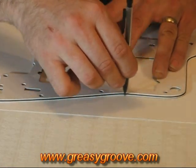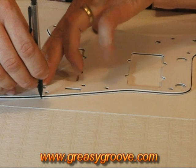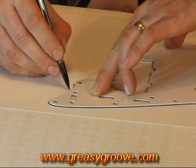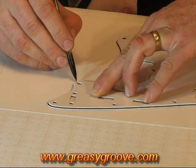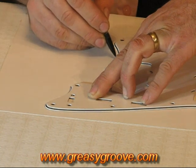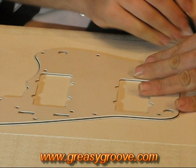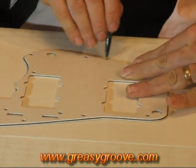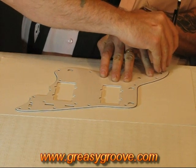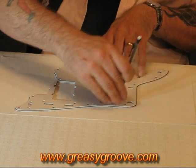So I'm going to first of all draw around the perimeter. I'm just taking my time as I go around. What I'm doing is keeping the lead on the pencil pointing towards the guard and pointing towards the edge of the guard as I go around and trace. I'm keeping the lead pushed up against the side of the pickguard and making sure that we don't have a gap. Because the more accurate you are with the tracing, the more accurate we can be with actually manufacturing your new pickguard.